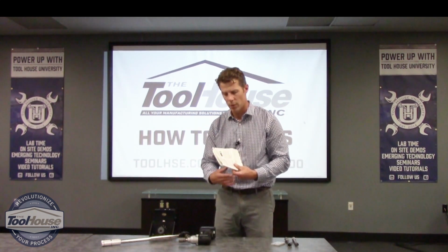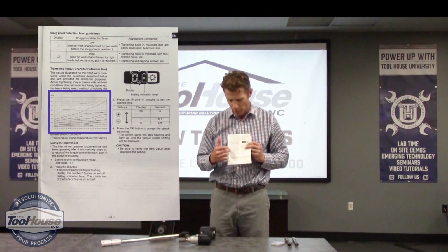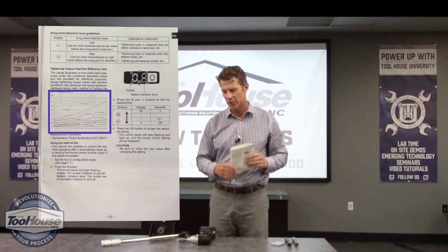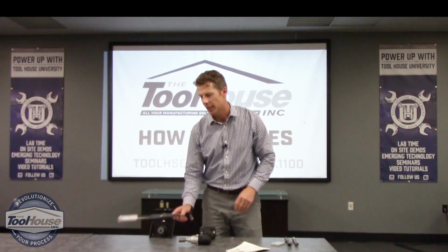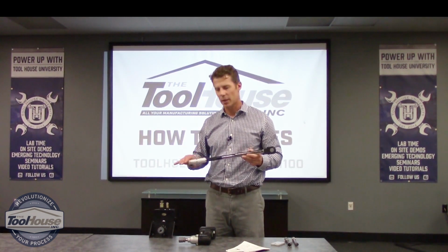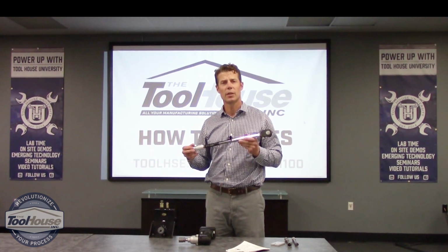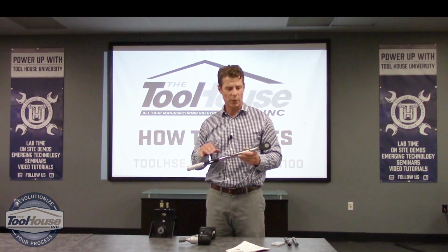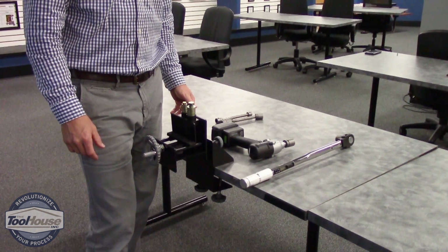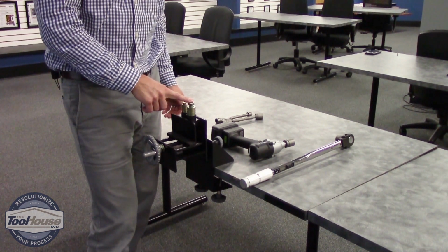Also, Panasonic in their manual gives you a rough graph on where to set the tool. So it's nice to have this with us. And then lastly, in order to make sure that we have the right torque left in the actual application, we're going to want to test that particular residual torque with some kind of a digital torque wrench.